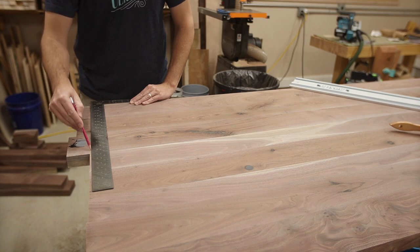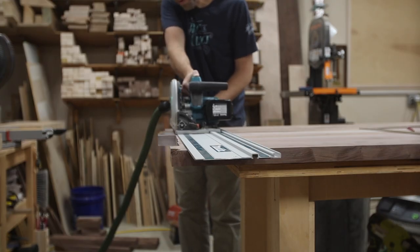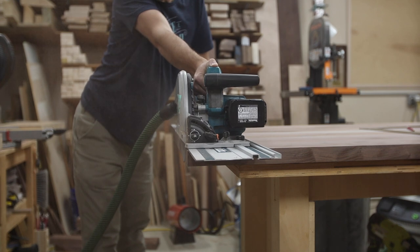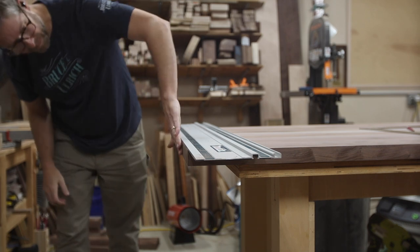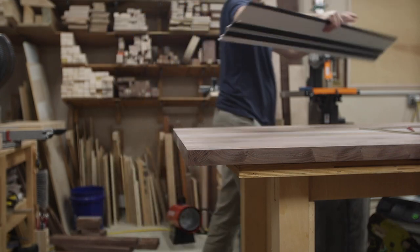When you're making a table and trimming it to size, if you cut through some hardwood you get lots of smoking and burning — it's not fun to sand off. An easy fix is to leave a little bit of extra room, move your track over after you make that cut just enough to do a cleanup pass, and you'll remove all of the burning.